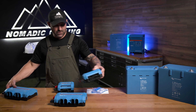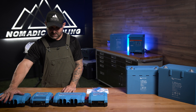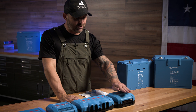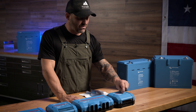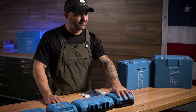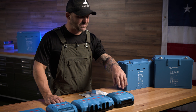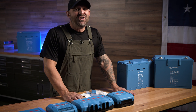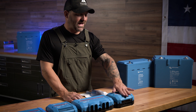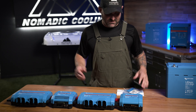You can also put the Lynx BMS back over here, with the Lynx Power In coming through your BMS over to your Lynx Distributor. Let's say you're very worried about a certain portion of your electrical system and you want to measure it differently. For example, if you want to know exactly how much power is coming in from your secondary alternator, you can plug the secondary alternator right into this side of the shunt and measure that specifically. Or if you're worried about your air conditioner, put it over here and it'll measure the amp draw specific to that appliance.